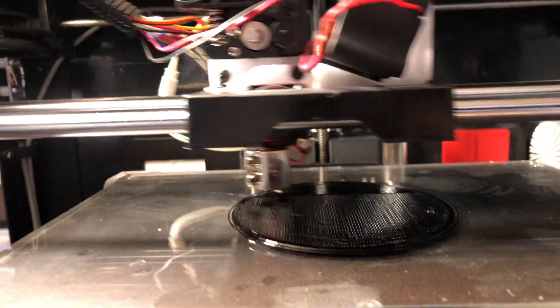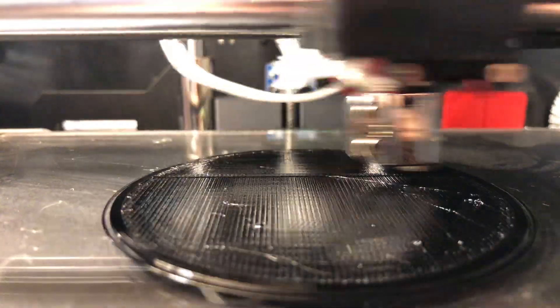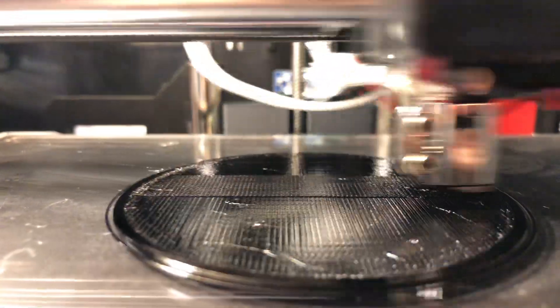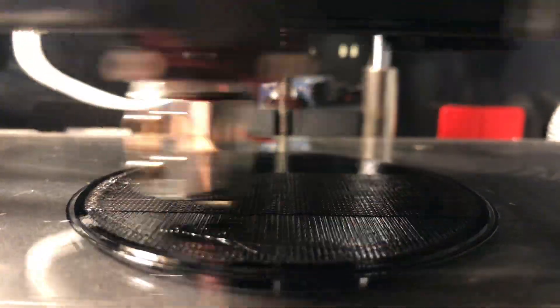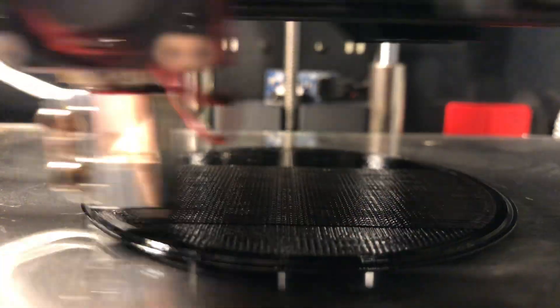So let's bump the speeds up right now from baseline to my line. You ready? You will see glossiness is reduced, but that's because the plastic is printing a little cooler right now — just because of the speed. It doesn't have enough time to over-melt and shine like that. But that was my point. That's exactly what I was stating, and this is my proof for people who don't believe — for non-believers.